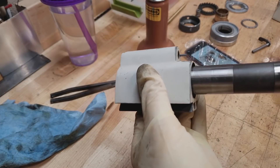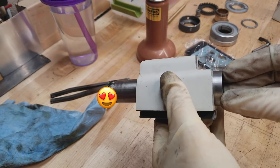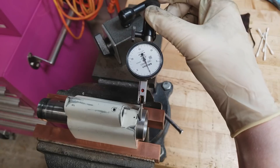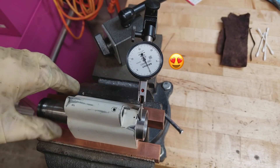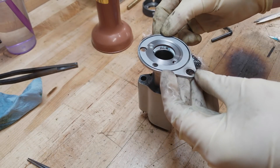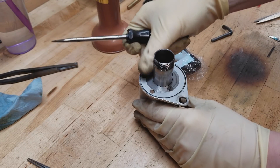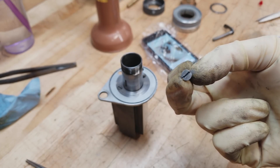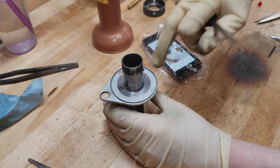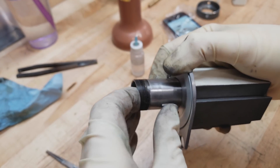Using way oil on the moving parts sealed away from the grinding dust, we can now slide the spindle back in the bore. I wish you could feel the quality of this fit — it's really, really amazing. After all that cleaning I wanted to check the runout again, and look at that: there's maybe a couple of tenths on it. Really, really nice. Some light oil on the machine surfaces and we can start reassembly. The aluminum trim ring goes back on. That screw had a little burr from earlier where I damaged it, so I took it to the emery cloth and smoothed it out. The trim ring has moving parts sliding over it so I didn't want that burr causing issues. The repaired key goes back in really nicely — that turned out great.